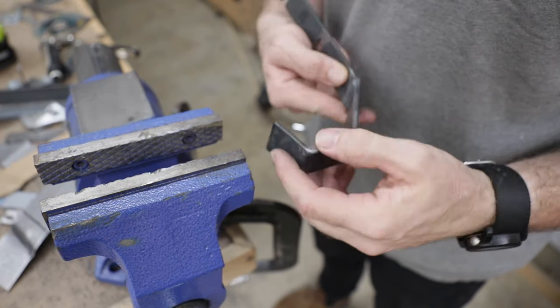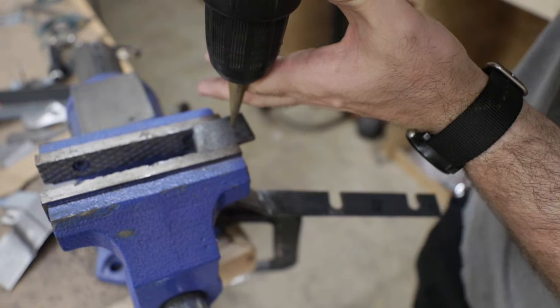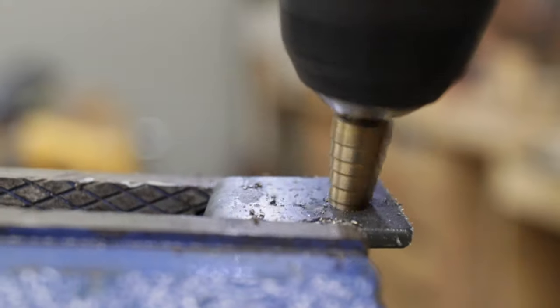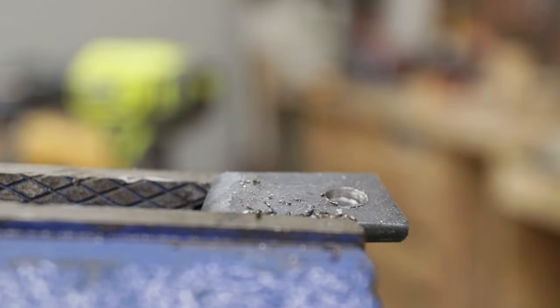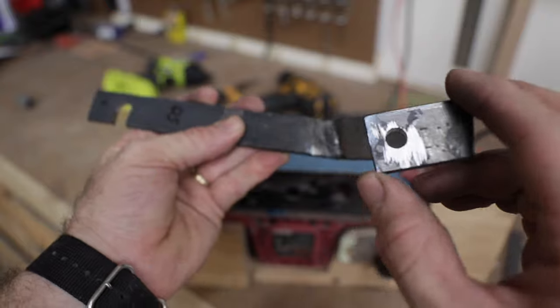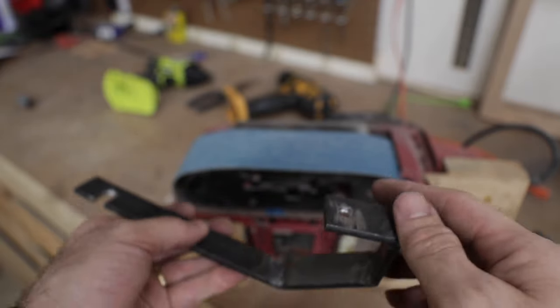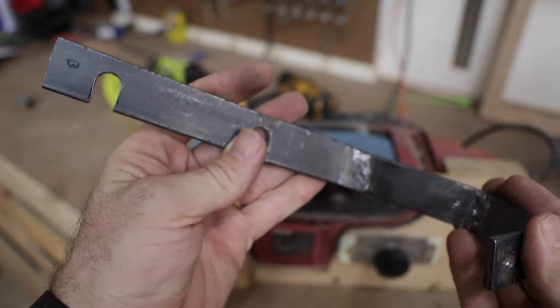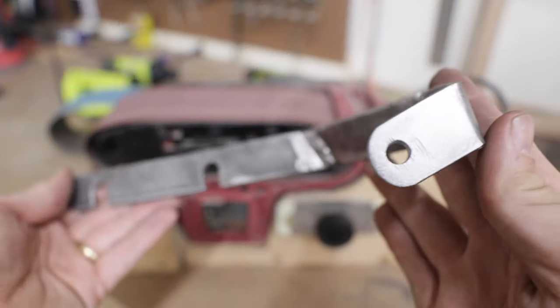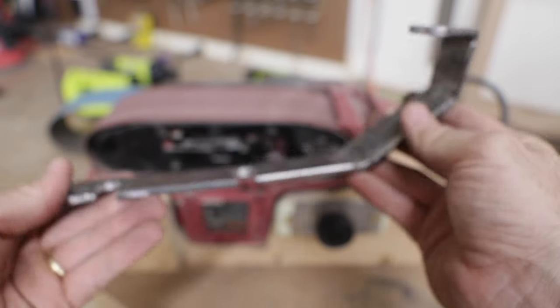Now I need to drill a hole in this top little mounting tab to mount our ditch light. You could have done this earlier when it was flat and it would have been a little easier, but oh well — just going to kind of eyeball this one. Drop the bolts in, make sure that fits. Now for the final touches before paint — in my opinion, the thing to take your project from DIY to more professional looking is rounded corners, especially with metal work. So we're going to put this on my upside down belt sander, which I use all the time. If you're not using a sander somewhere in your project, you're probably doing it wrong. Let's knock off these corners.